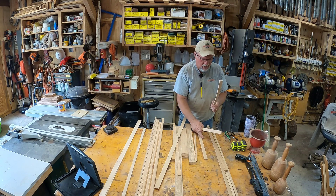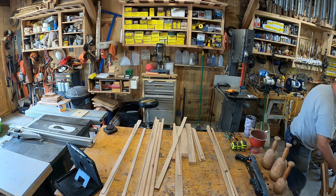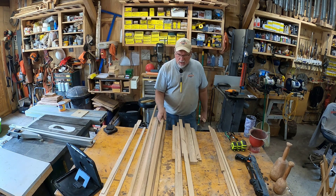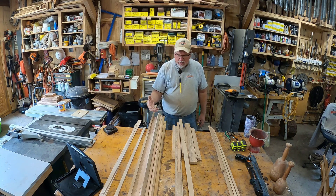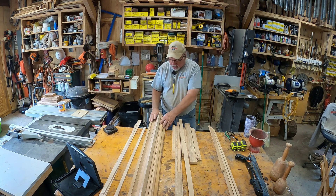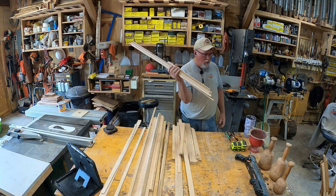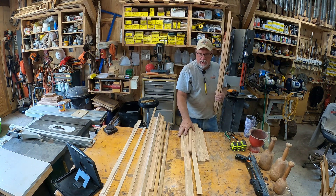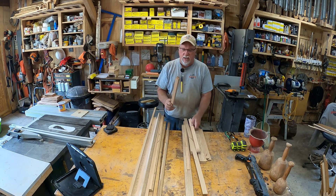I might cull out some things that just aren't going to be worth it, but there shouldn't be too much of that. I'm going to have to cut them into usable lengths — I usually like to make the boards 24 to 30 inches, maybe a little longer, that I glue up to cut into strips for the boards. This is all white oak here; there's not enough to work with yet but there's more in the buckets. I'm going to do this one bucket at a time, glue up what I can, and then move on. This is all my willow oak and this is what I'm going to start with.